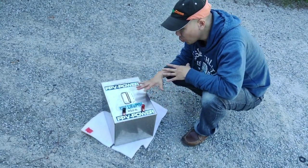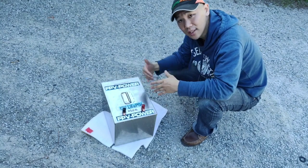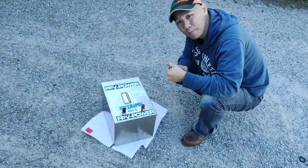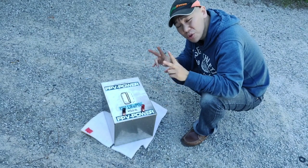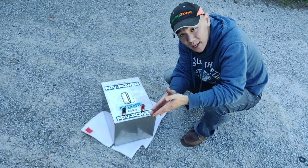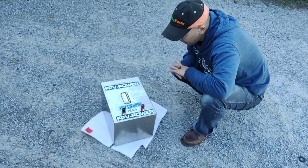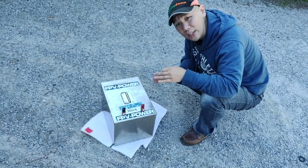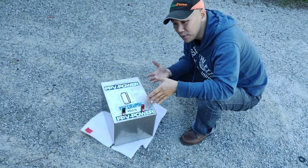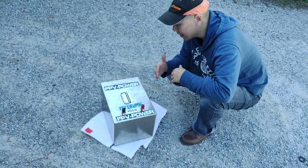Now with that, having the weight of 130 kilos versus a single battery, half the size, and with the weight it's only 38 kilos versus 130 kilos. At 440 of the lead acid he only could use half if he wanted to keep the 350, 400 or so life cycle that is recommended by the manufacturer. That's basically, yeah, discharge under 50% and charge again. So 50% depth of discharge, DOD. The customer actually mentioned to me that he always tried not to hit the 50% mark, which means he had to be really careful with the power he used. And at times on extended trips he had to go below 50, but he always tried, always on his mind, not to go under the 50% mark.